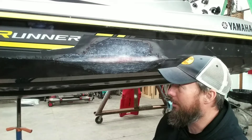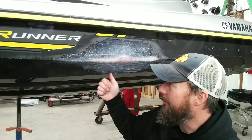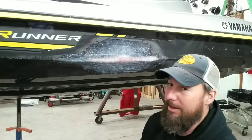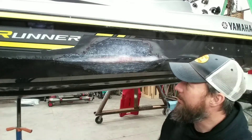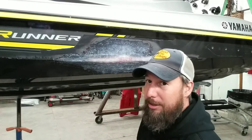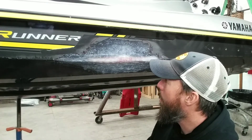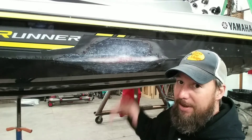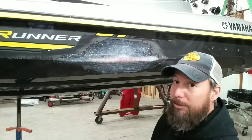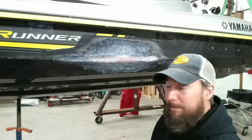I don't like sanding, so we're going to hot coat this right now. But instead of hot coating with another layer of epoxy resin, I'm going to hot coat it with Total Boat epoxy fairing compound. Looking through it, there's only about this much area that needs any real build — the outside edges are pretty close. The fairing compound is going to be a lot easier to sand, and since it's epoxy-based, there's no compatibility issue. Let's go mix some up.